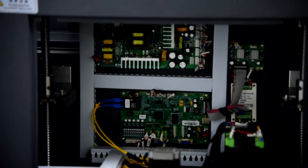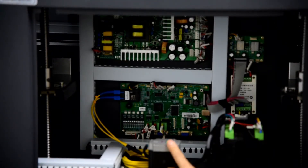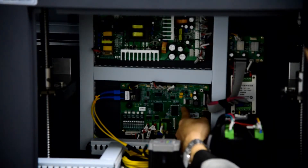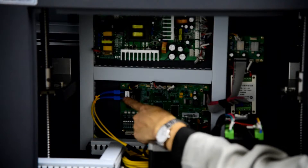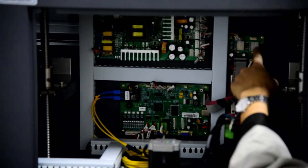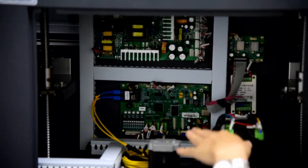On the left side of the machine, open the cover by pushing down the lock. Inside is the main electronic system. You can see the up-down motor to control the flatbed up-down motion and its motor driver. There is also a motor for flatbed forward and backward movement. The main board — the CPU — is the heart of the machine, with many plugs for motors, sensors, and optical signal cables connecting to the carriage board. There is also a cap station motor board to control cap station up and down, and a signal box to control table up-down motion.